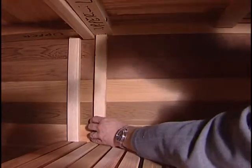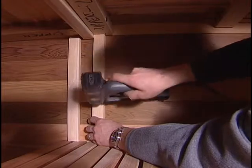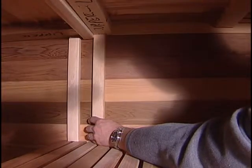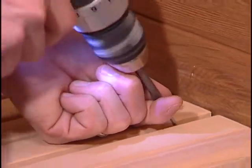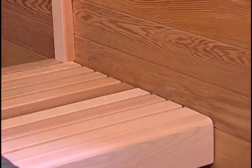Set a 15-inch 1x2 leg on the lower bench underneath the upper L bench. Fasten the leg to the wall. The benches must also be fastened to the wall at every point the bench meets a wall.